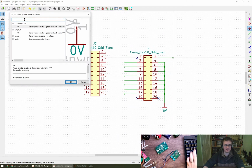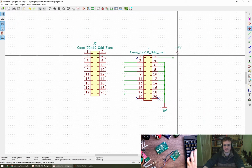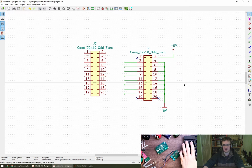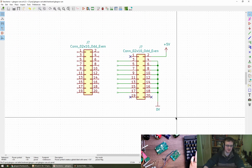We're going to require this to be a 5 volt supply, I think, because of how CAN works. So there are options which allow us to use a 5 volt supply, which will then drive the bus, and a second supply to do the I/O. But given that Glasgow can only provide 1 supply per channel, and also Glasgow can deal with 5 volts I/O, let's just go for 5 volt.